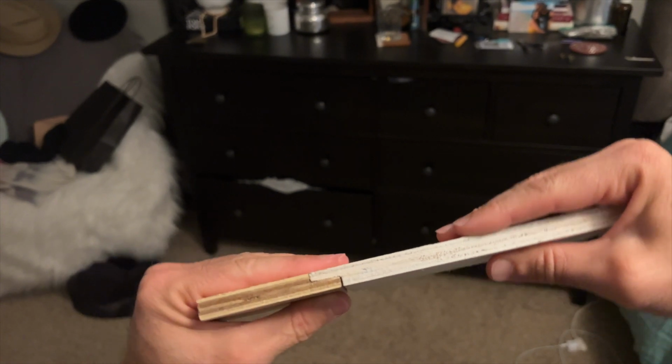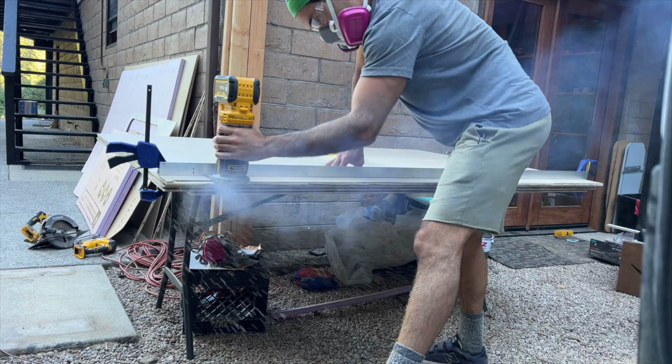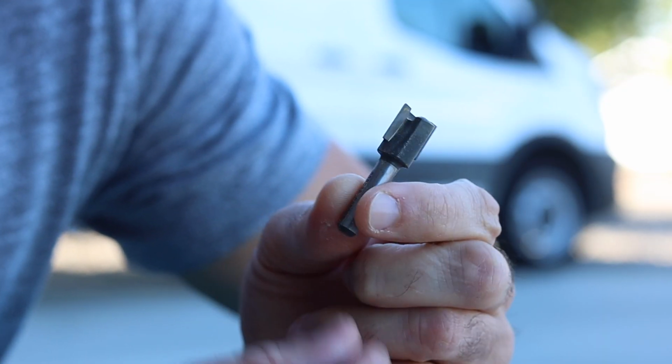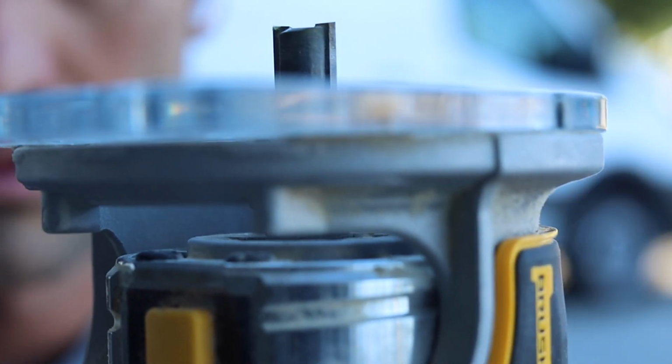After that, grab your 4 4x8 sheets of plywood and create your half lap joints. A half lap joint is a joint that prevents 2 pieces of wood from separating under force or pressure. It looks like this. In our application here, you're gonna cut away half of your 1/2-inch plywood, creating a little ledge. And you do this using a router tool. I used a 1/2-inch router bit. What you do is you adjust the router bit so it protrudes about a 1/4 inch, therefore cutting away half of the plywood's thickness, thus creating a half lap joint.